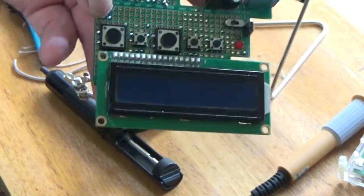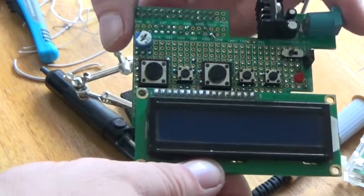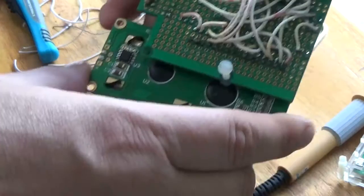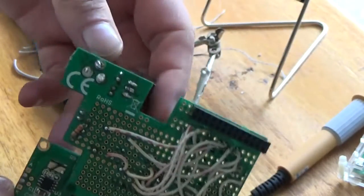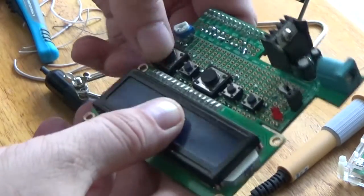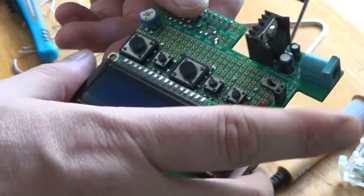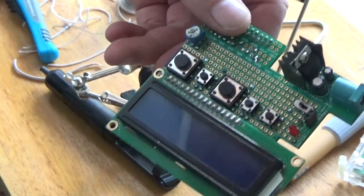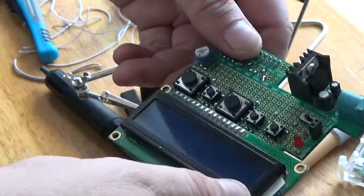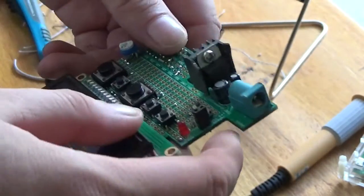This is my almost-finished MP3 player for the Raspberry Pi. I'm using a Humble Pi kit. This is my first time soldering, so it looks really messy. I have all the buttons, the 10k pot, and the LCD working, but right now it has to be powered by 5 volts. The regulator I have is a 3.3 volt for the rail, but I don't want to always have to use an AC adapter.